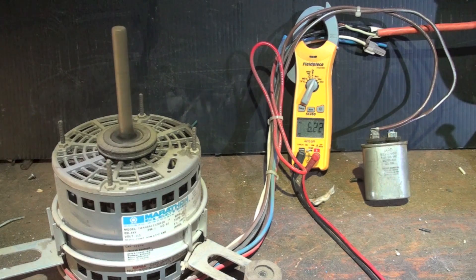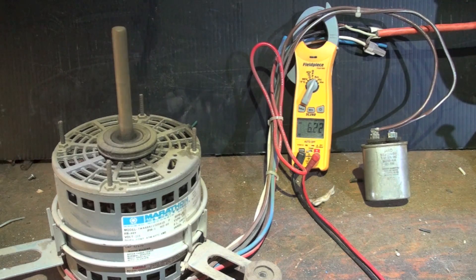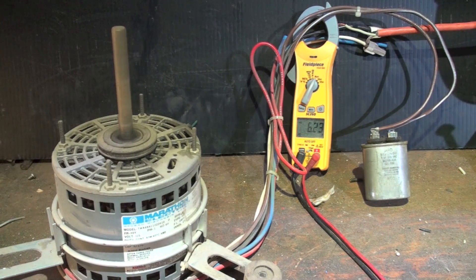That's pretty much it on that one. One of the things with troubleshooting: if you come out and the motor won't start but it draws a lot of power, you might check that cap. If the cap's bad it'll definitely do that. Just a little experiment.